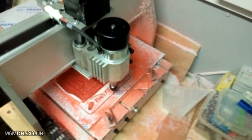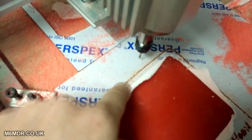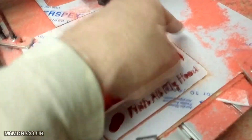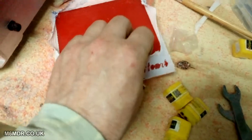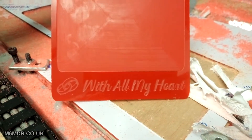Now it cut out okay. It was a little bit shallow as I thought along the back, so what I did was put the cutting bit inside the channel a little bit, zeroed it a bit deeper, and then sent the cutter back round a couple of times just to finish off while holding it in place, keeping my hand out of the way. It was easy to cut out — look at that, it's just come straight out. I milled the tabs off because I had to hold it in place since it wasn't deep enough. Doing some peeling now — I'll peel this and come back.